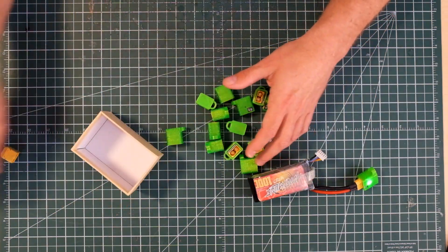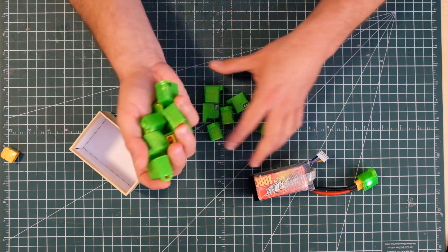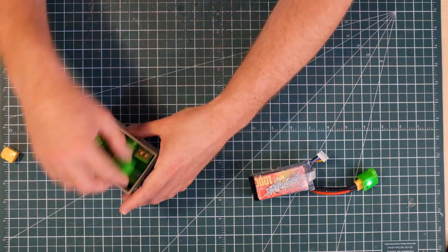I've got about 20 of these things. All my batteries — I just jam one of these on the XT60 connector of every one of my batteries and leave them overnight. When I wake up in the morning, they're all discharged. They are slow — they discharge at a rate of 500 milliwatts. Don't get that confused with milliamps. The nice thing is they don't create a lot of heat, so you can put a whole bunch of these in a bag together. You can have 10 batteries in a LiPo bag with one of these on each battery and it doesn't create much heat.